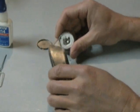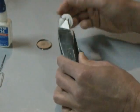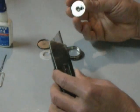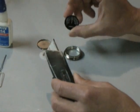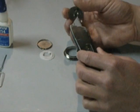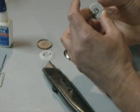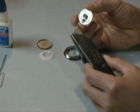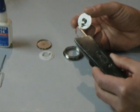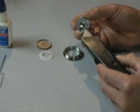Next, you want to remove the plastic spacer ring — just lift that out of there. The whole thing came along with it this time; usually that doesn't happen. This would normally stay in place, but this is what you want to get at anyway. This is your main thermometer dial with your thermal coil attached to the back side. You'll also see that the thermal coil — this coiled-up piece here — is attached to a little plastic aluminum tab. That aluminum tab is glued to the main dial face.